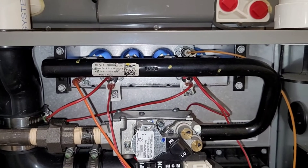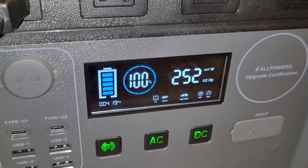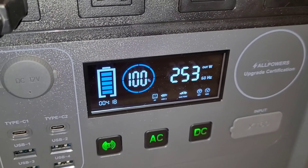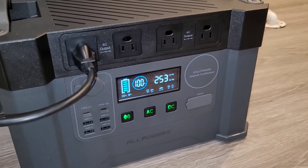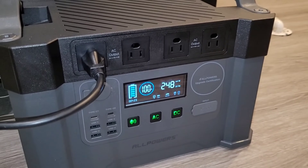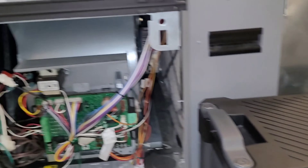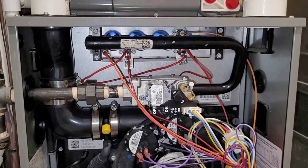At this point if the furnace is still running you should be out of the woods — you've verified your flame and everything is happy. At 250 watts, this S2000 would give me four hours and 20 minutes of run time. Furnaces don't run all the time — they run about a half-hour cycle — so that would definitely get you through the night and through most of a power outage. You can always put the unit out in the sun with a solar panel the next day and get more charge in it. I do prefer the solar option nowadays — with a gas generator, the one time I needed it I had a bad spark plug and it was absolutely no use to me.